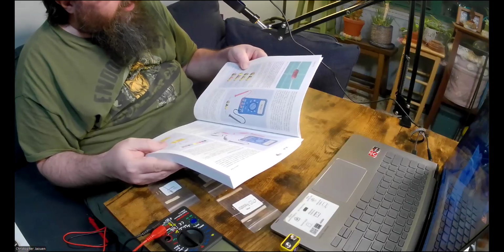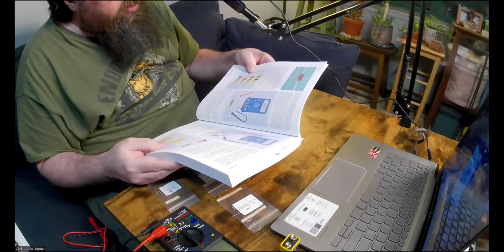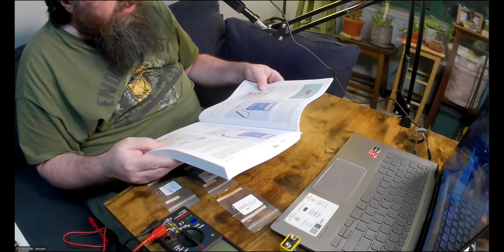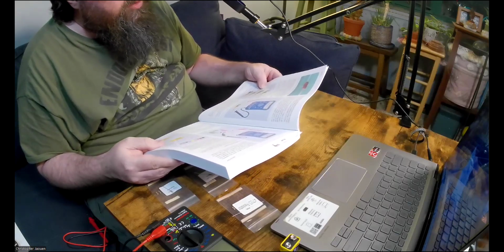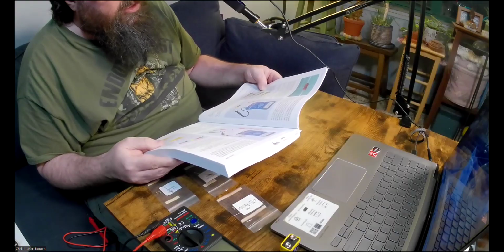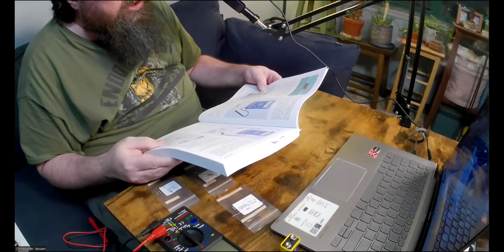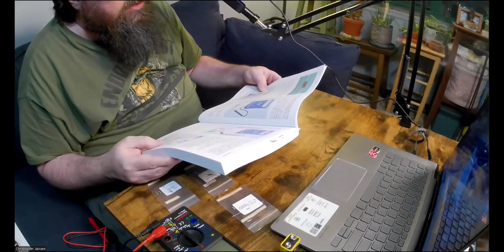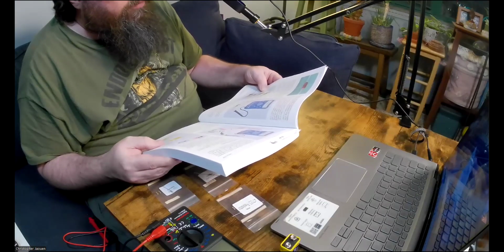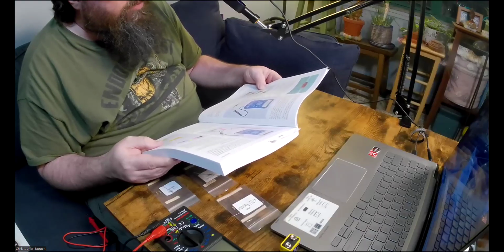is still in the volts ohm socket of your meter as in experiment one. The 15 ohm resistor has a value that is much lower than that of your tongue, so you need to select a different resistance range. A value of 200 ohms is often the lowest available, so try that one. The resistor can be either way around, it makes no difference. Place it on a surface, such as wood or plastic, which doesn't conduct electricity, and hold the probes by their plastic handles. If you touch the metal ends of the probes while trying to measure the resistors, you'll also be measuring the resistance of yourself, which is not what you want.